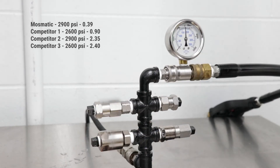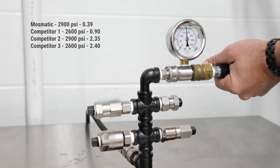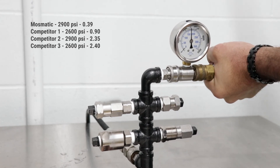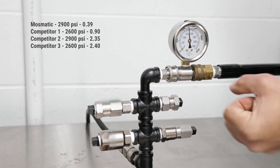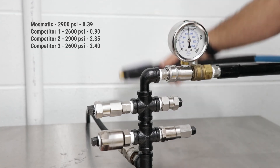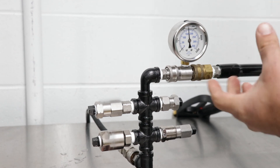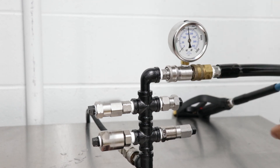As people have mentioned: why do I need one when I have a twist coupler? Just to give you an example — this is under pressure and this is not twisting easily at all. I can throw a wrench on there and check the pressure to get it to twist. But again, a quick coupler is not meant to be a swivel — it's just a compression connection and the O-ring is what really seals it. With pressure, it's just locked into place.